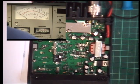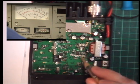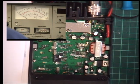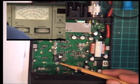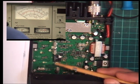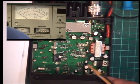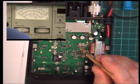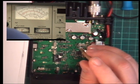So the only adjustments are presets, variable resistor presets. So one of these is going to be power. I would think that one's in the receive, because you've got the filter there. That could be something like some squelch setting, I don't know. That's near the audio IC. I'd expect that to be AM modulation. So we've got these 3 to fiddle with. So we'll see what happens. We'll start in the middle.